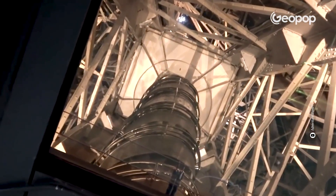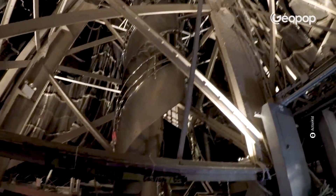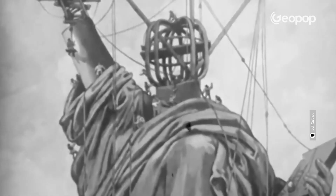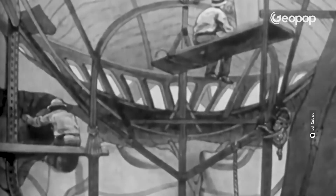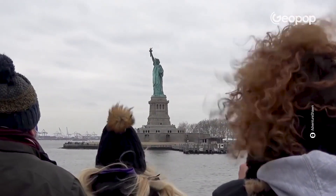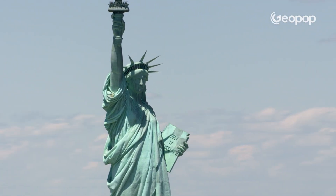So, let's see what's inside the Statue of Liberty. The skeleton of the Statue of Liberty is a lattice structure made up of columns and trusses, which are connected to the outer cladding of beaten copper panels with rivets. Eiffel decided not to utilize a rigid connection between the skeleton and the cladding, as this approach could have caused tension to form and subsequently surface cracking. The use of rivets allows the parts of the outer cladding a certain freedom of movement and reduces the tension generated by the thermal differences between the outside, which is exposed to the weather, and the inside.